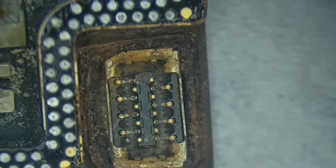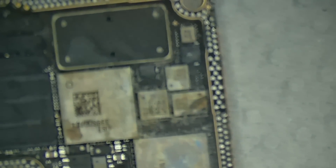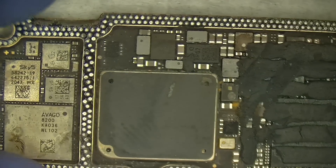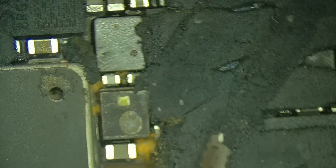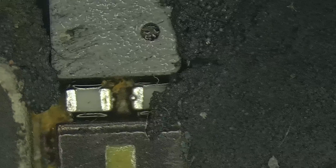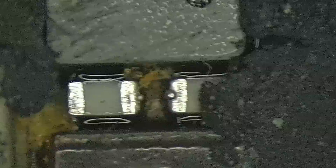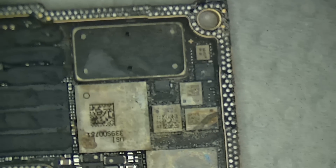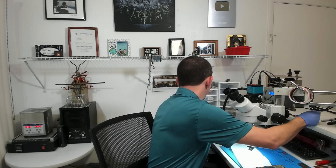I'm going to throw the bottom board under the microscope. Isn't that lovely — in all of its glory. This whole entire bottom board, everywhere you look, has gotten wet down between everything. And what do we have here? Yes — ball squeezage. I wasn't too terribly concerned with the bottom board because to recover the data I used a known good bottom board, so this one pretty well just got tossed aside.